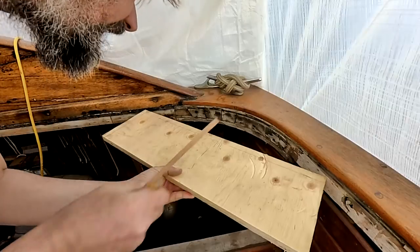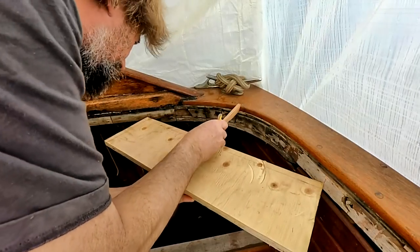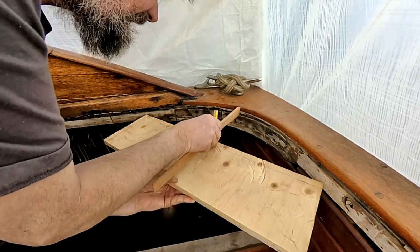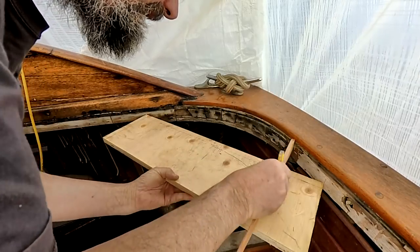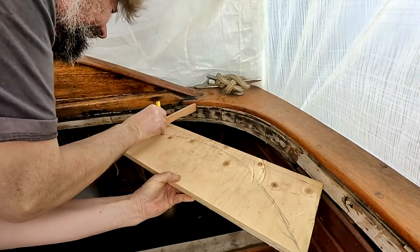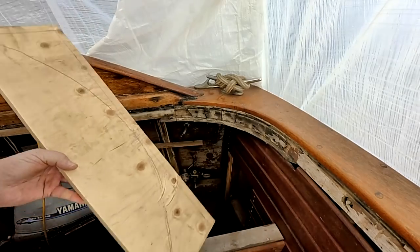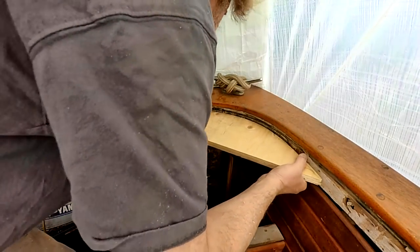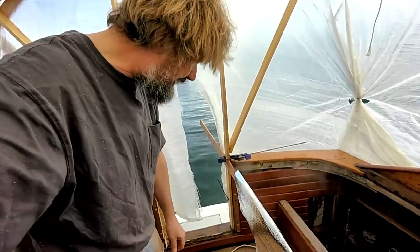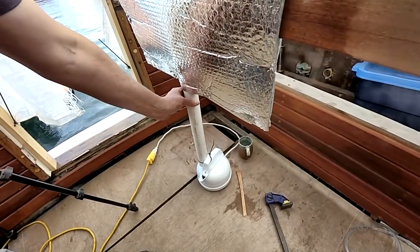Once that's set in there, all I need to do is set my pencil at roughly the depth of the maximum throat of the scribe, keep it parallel to one side, and draw. This is a rough start — you can see it's kind of rough — but that side came out a little tidier. I'll cut it to roughly that and see if it needs trimming. No one needed to see me make that cut on the table saw, but actually that's pretty darn good. Let's look at the steaming — isn't this great? Steam pouring out both sides. I'm loving it.